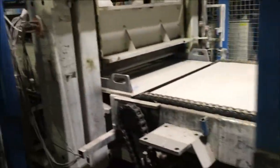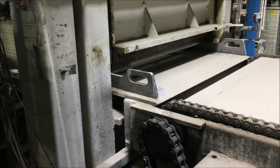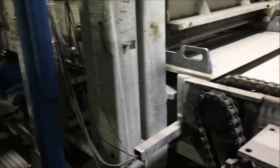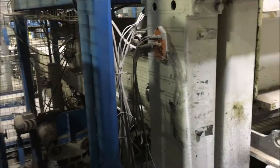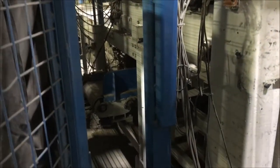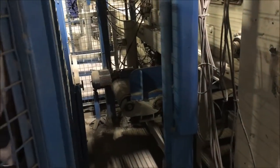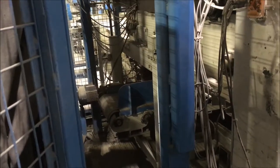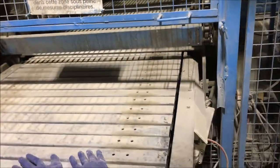Product is fed by an ACP bar feeding system onto the hydraulic splitter — top and bottom blade. The product is then driven by the ACP bar, and any cuttings are discharged to the scrap conveyor underneath. Here is the control station for the splitter, just over the splitter itself. The product comes here on the slab conveyor.